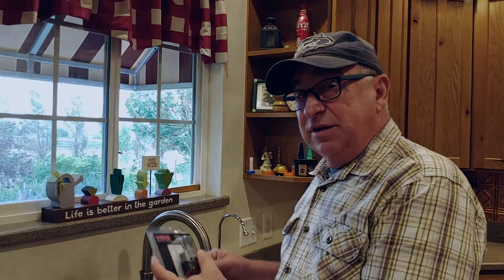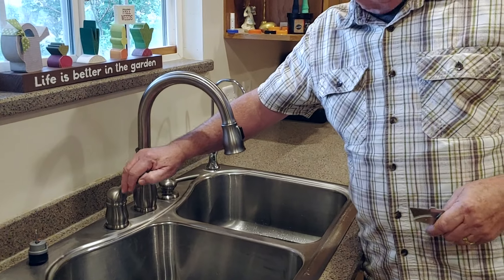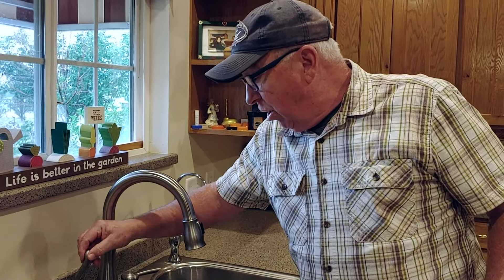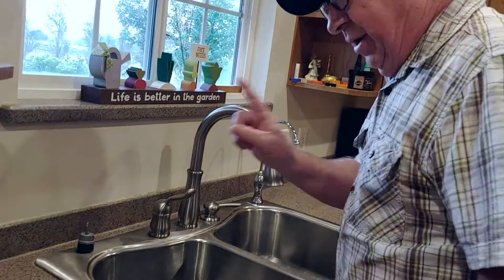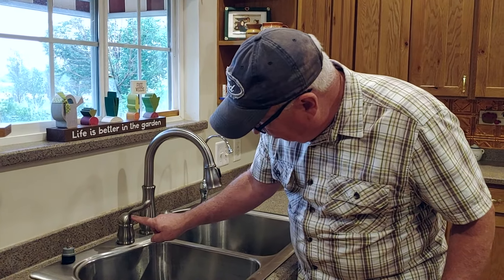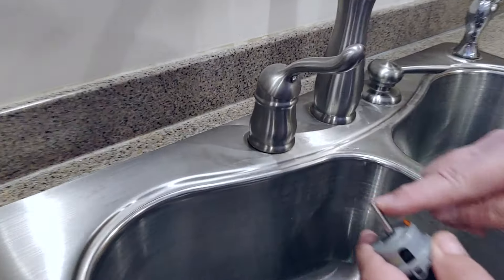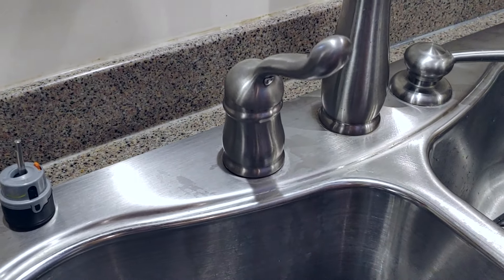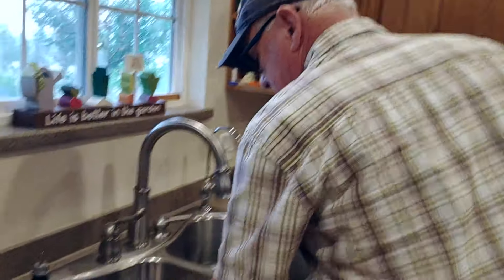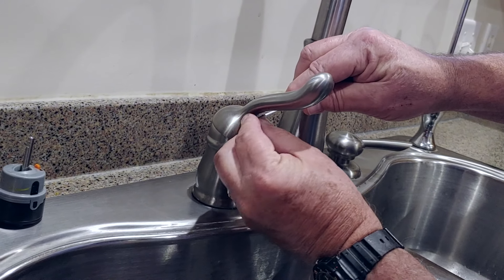Let's get to work and take this apart. Here is our replacement cartridge — we'll put that in here. I've gone and turned off the water; make sure you do that or you're going to have a mess. As you can see, we have no water pressure now at all. The next thing we need to do — here's something to be careful of. We're going to pull a little hot/cold indicator logo out from under this, which covers the Allen screw that attaches the handle to the stem. If that thing falls off and goes down the drain, it's not going to be a good day. So I'm going to take a dish rack and put that down there. We're going to put a little screwdriver under that and pull it out.